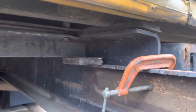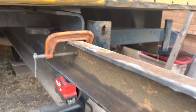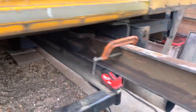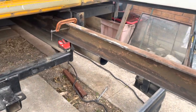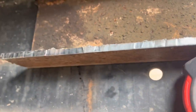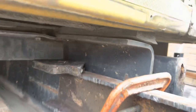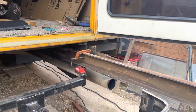So we've got everything mocked up for our welding and tacking. We're gonna add some reinforcements and add some nuts and bolts just for safety — we'll cut holes in the frame and add those bolts. We went with quarter inch C-channel, which is basically what the frame is made out of — it's just a bigger version, but it is quarter inch — so we're going to match that strength.